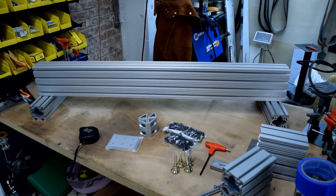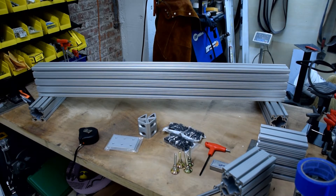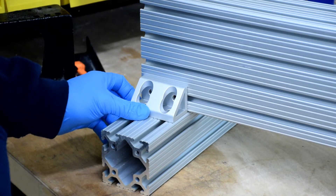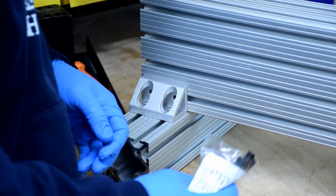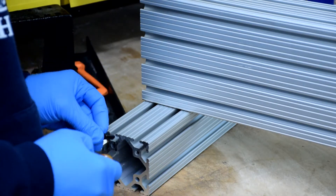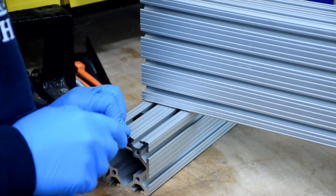Let's go ahead and set up your 48 inch piece of 3060 on the 3030 — those two 12 inch pieces you have there. It's not too important how centered they are at this second, just kind of get it close. We're going to attach the bed to the base with these angled brackets here. You should have a whole bunch of T-nuts and bolts that go in there — these slide into the extrusion and make it real easy to put things together, giving you a nice anchor point pretty much anywhere you want on the extrusion.